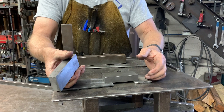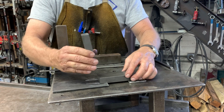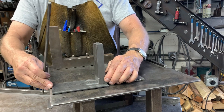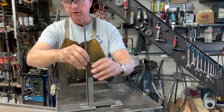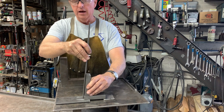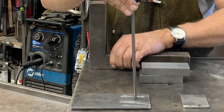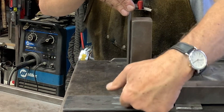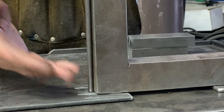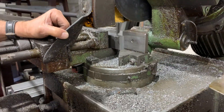Using this nice three-quarter by two-inch flat bar, I'm going to cut and make an 'unsquared square' so that when I weld on this side the part will be held off perpendicular, and then I can just move it over to perpendicular with another square and perhaps weld the sides. So I'm four degrees off of perpendicular.